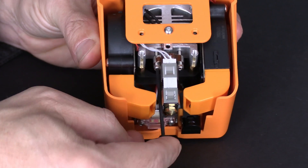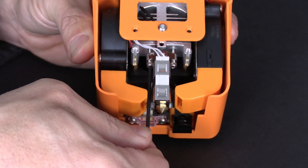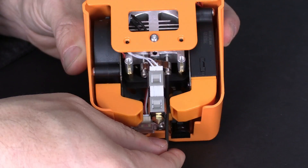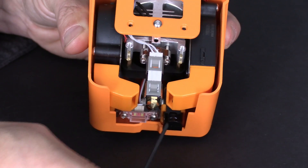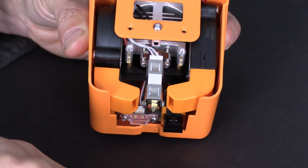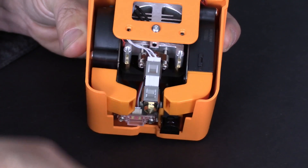To adjust this, simply fit an Allen key over the screw and turn it clockwise. Do this to both sides. You don't need to go overly tight — just be sure both screws are firm and there is no movement on this hotend.